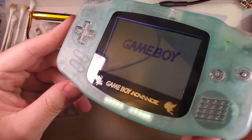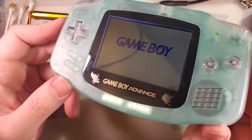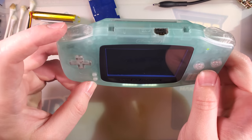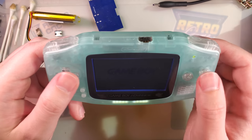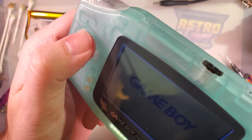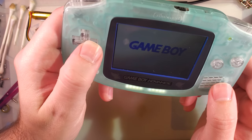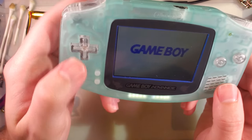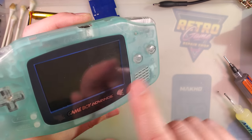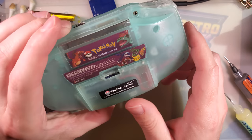It's got an AGS 101 LCD. Yeah, they're not that bright. That's genuinely how bright that's supposed to be. All the buttons except for the shoulder, well, okay. D-pad and A and B are modified with clicky tactiles. Can't really hear it because of the buttons I have installed. I'm using little custom 3D printed TPU adapters for the buttons onto the tact switches. Feels fantastic, by the way. Way better than originally